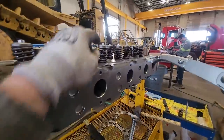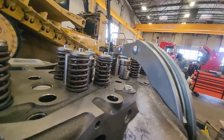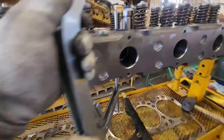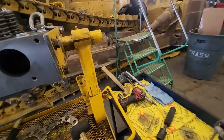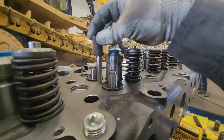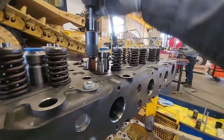Now if you look at where the valves are, you can see there is no valve seal — even on the head we got here. I didn't expect there would be valve seals because there weren't valve seals on the head we pulled off, and that head was only two years old. I couldn't find any sort of retrofit to add valve seals to this head — I'm sure there is one out there, but couldn't find one in the CAT system. So what was decided was that we're just going to replace the head due to the oil being on the valves — that's really the only place we could find oil in the engine where it wasn't supposed to be. Now of course you're going to get oil on the valves if it idles a lot, because you're not creating very much pressure in the intake ports. Even on a diesel at idle it doesn't have very much pressure in the intake runners, so it can allow oil to seep past the valve guide and into the intake port, which will cause oil residue to be on your valves and get in your cylinder.